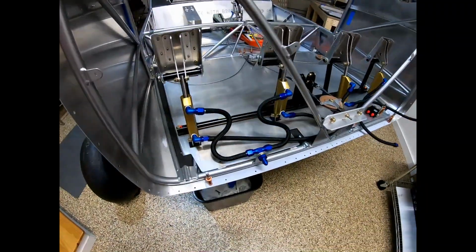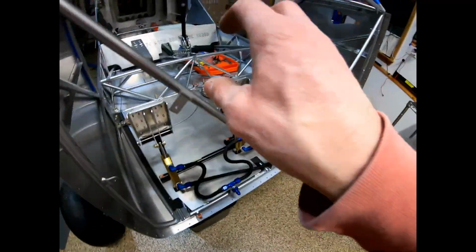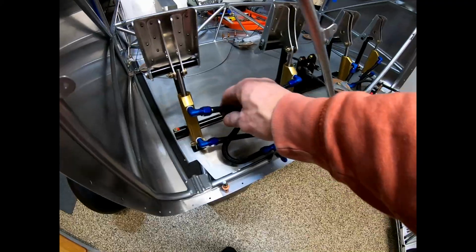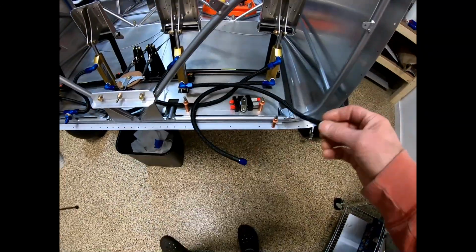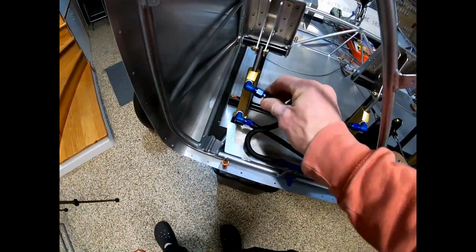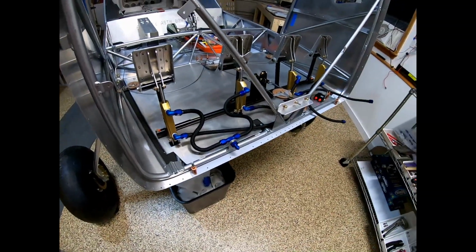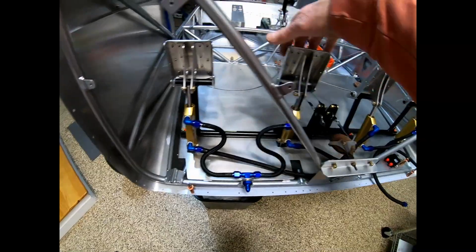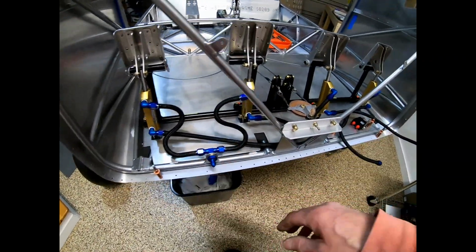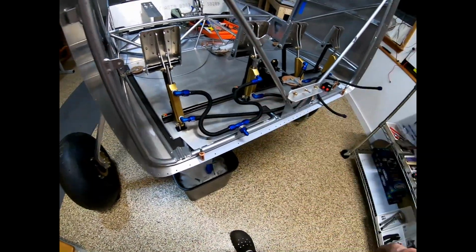But one thought was, they look messy, especially when you're looking from the other side down into, you know, a dark footwell, and you have these silver lines kind of going all over the place. So I just put some of that expander that we use for the wiring. I cut those and I put it on there, and it literally pulls right off for servicing, or if you've got to check for leaks or tighten them or whatever. So I think I might try that, at least if the carpet's black, the firewall's black, the nice pedals are silver, and everything else kind of just blends in. You don't see them, might not bother me as much. And it'll give it a little more protection.